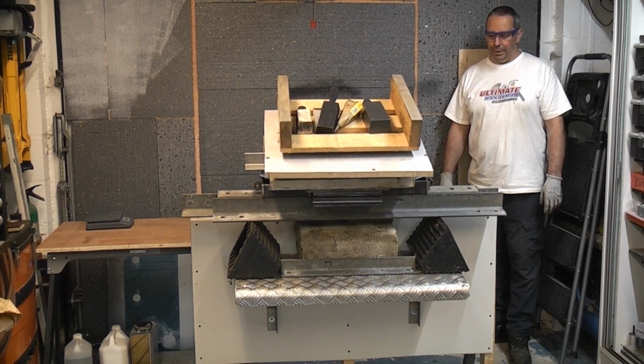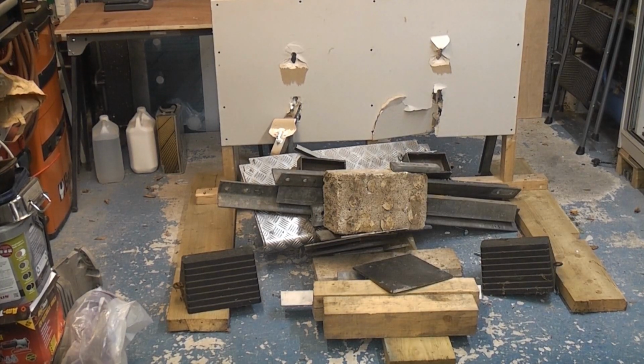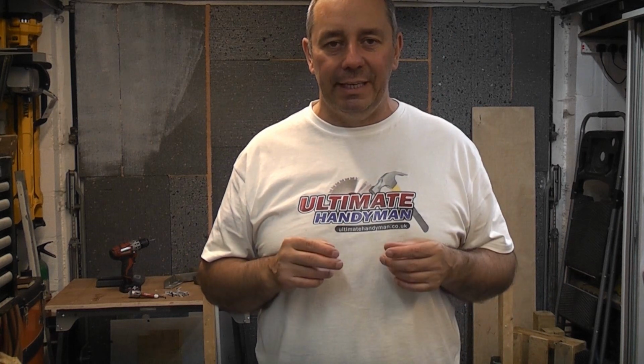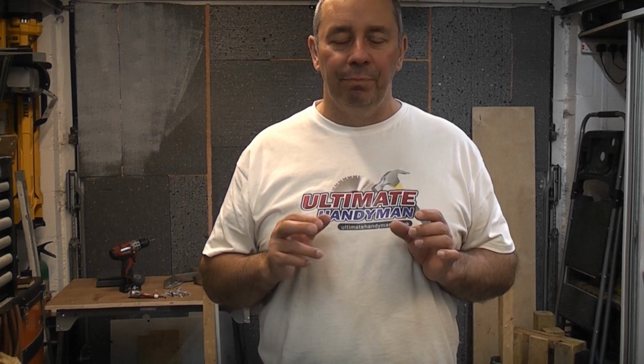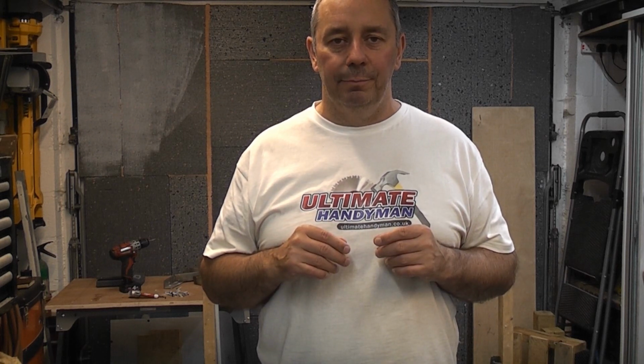And it is actually going now. So that was creaking for a considerable time and it looked like it was going to fail for a long time. But it did actually hold up. So despite being harassed by the guy that's invented the Bullfix fixing, or is marketing the fixings or whatever, the fixings do perform quite well and they are very easy to use. In this test they actually held 143 kilograms before the plasterboard failed.